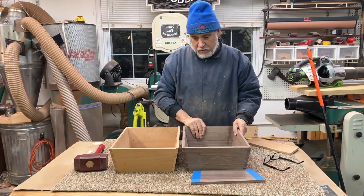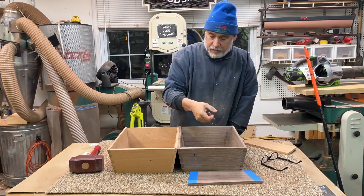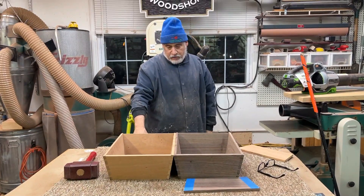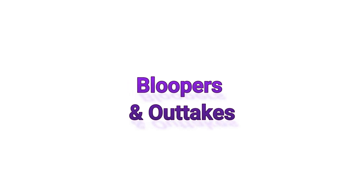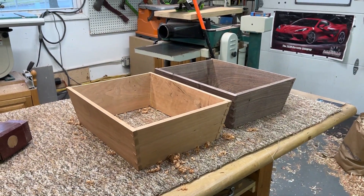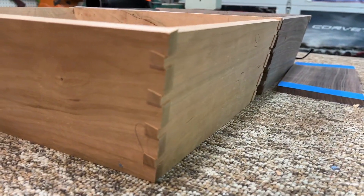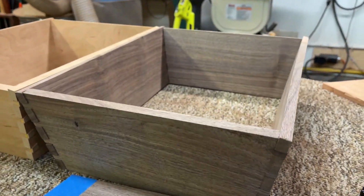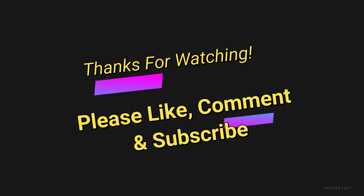The reason I didn't cut these bevels on the table saw first is I wanted to make sure I could line up the edges on the fingers. I could certainly cut this on the table saw, but we're probably just going to do that with a hand plane. I got two of them done — I didn't screw up, didn't even have to use my test pieces. I'm going to have to determine how I want to put the bottom in — whether a dado or groove, or just a bottom that sticks on. Also there's going to be a handle through the center — a nice little tool tote for their gardens. Hey, that's it. It's Tuesday, it's cold out here in the shop, it's dinner time. Tomorrow: it worked like a charm, got two done, once I got rolling it was real easy. Thanks for watching — please like, comment, and subscribe, and follow the link for part two where I'll bring it to completion.